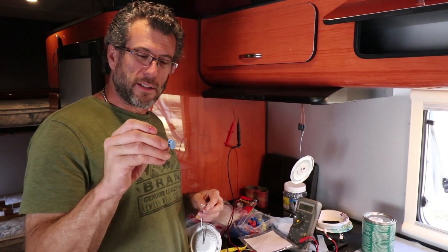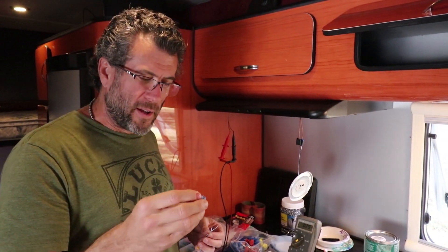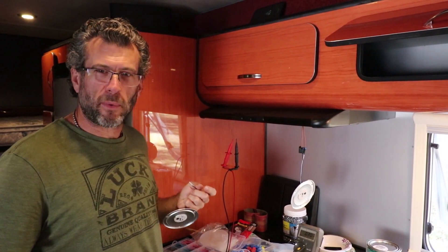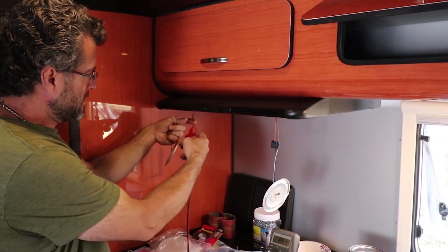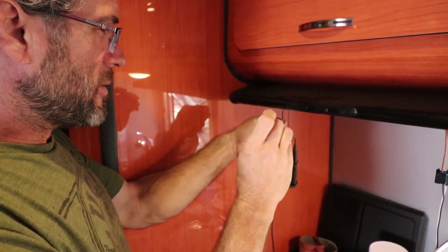When you're using these quick splice wire connectors — I use them a lot from my military days — you don't have to strip the wire. The reason we strip these little wires over here is because I couldn't tell the positive from the negative. So we're going to grab the positive first, which is attached to the red in this case. I don't want a 12-volt love connection.